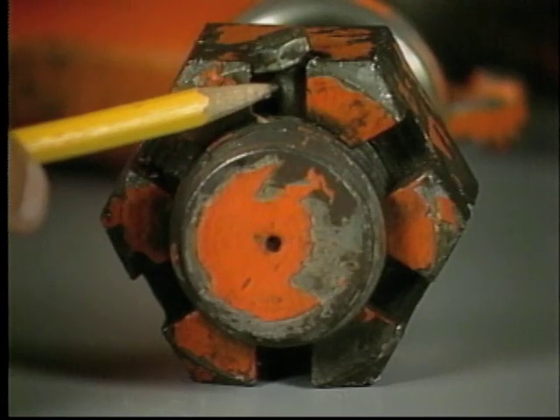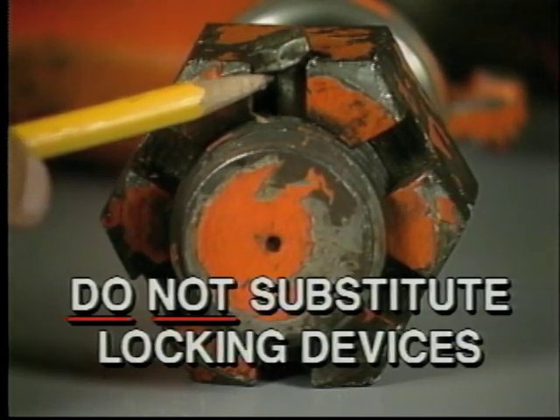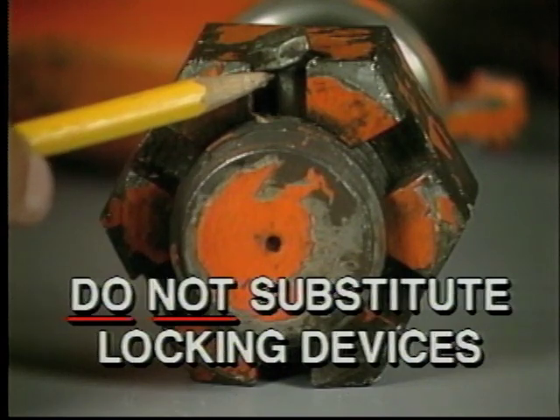Most field inspection of commonly used tackle will be visual, closely looking at tackle components for signs of unusual or substantial wear or deformation. Regardless of the tackle component involved, always inspect all nuts, bolts, and pins used in the component's assembly. Retaining nuts on all bolts and pins should be checked to ensure they haven't backed off or loosened during operation. Re-tighten any loose nuts and pins and then lock them into place using the original locking method and device — stakes, set screws, cotter pins, retaining rings, or cap screws. Do not try to substitute locking devices, as this will affect the integrity of the locking device and could create a safety hazard.